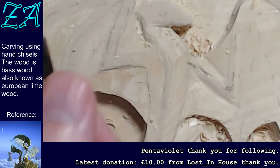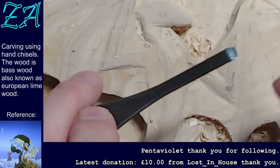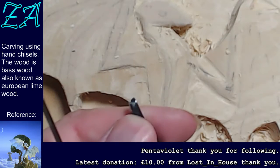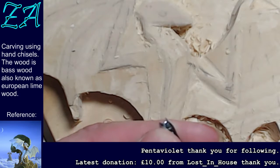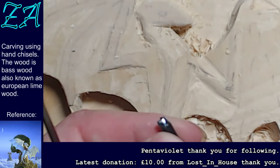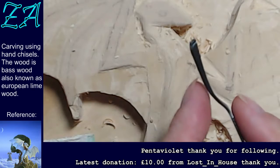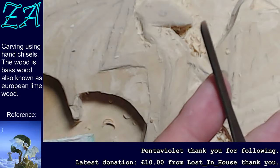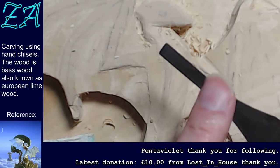The flat chisel is less flexible in a way, despite the fact that these are called flex tools. Just because you've got cutting edges all around, 270 degrees, both sides and the bottom, flat on the sides and then rounded on the bottom. It's spoon shaped, so you can dig in and come out, which you can't do with a flat chisel. If you dig in, you can't come out, you're stuck.